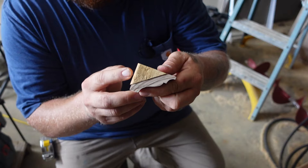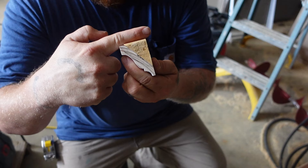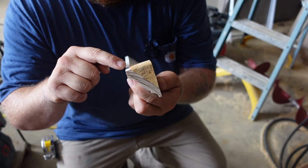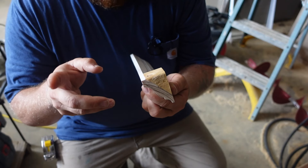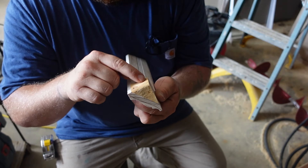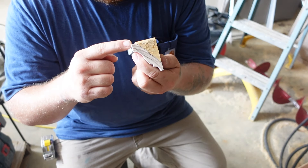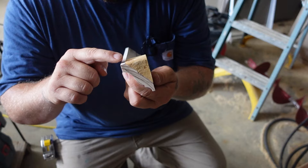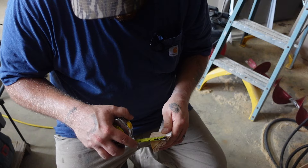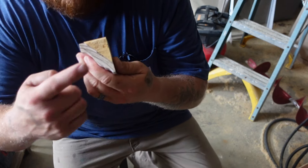Here's our crown sitting on the wall. We're going to take our little block and he's going to sit just like that. From your crown, imagine your ceiling sitting here — you want to leave a gap for the light to shine through. I want a quarter-inch gap. My light strip is half-inch wide and it'll go right in the corner. So this block needs to be a quarter inch less than flush — that makes it an inch and a half on my 90-degree side.